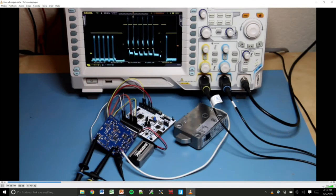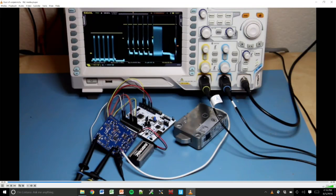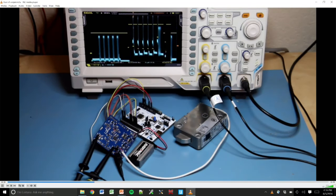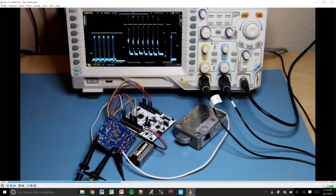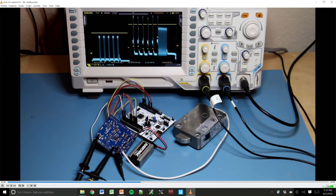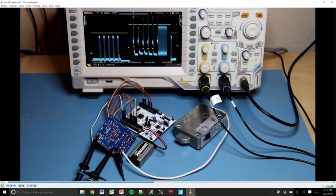As it cycles through the various possibilities for the key code, it has to do some oversampling. So in a real world environment, there's noise, so we want to try each of these potential combinations multiple times. And so for that reason, this video is actually sped up by a factor of 10 to fit it in the presentation. Even so, the full attack in a fairly robust manner takes about 15 minutes, which is a huge improvement from the potential 3.8 years that a naive brute force attack would take on the lock.